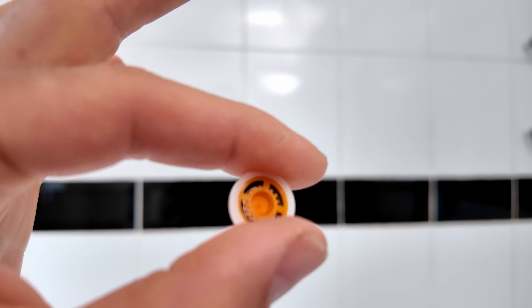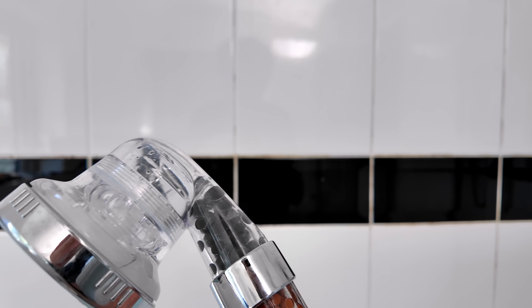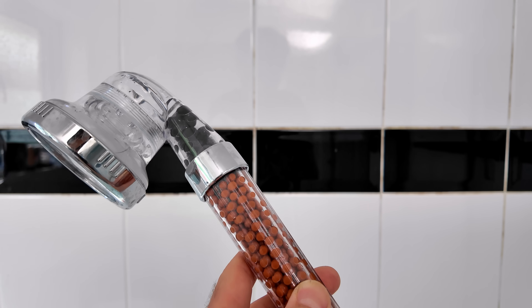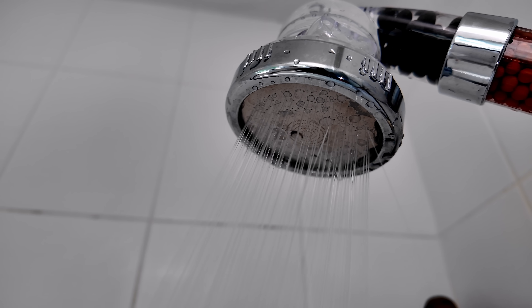On the shower, you also have to tightly control your flow rate. I'm using flow limiters — a little disc that goes between your shower hose and the shower head. I've got a five litres per minute flow limiter installed and I'm using a special low-flow shower head. It has tiny waterways, so with low flow, the jets shooting out have much higher velocity and feel like way more flow — they feel like much better pressure.